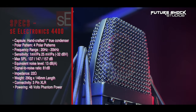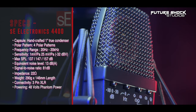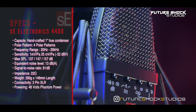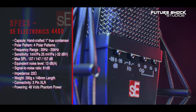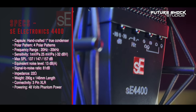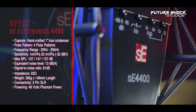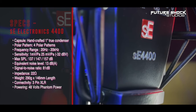So as already mentioned, the capsule type is a handcrafted 1-inch gold-sputtered true condenser microphone. You get 4 polar patterns. They are cardioid, hypercardioid, omnidirectional, and the figure 8. The frequency range is 20 Hz to 20,000 Hz. The sensitivity is 25 mV/Pa. And the max SPL is 137 and ranges to 157.